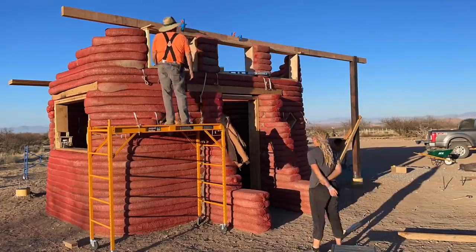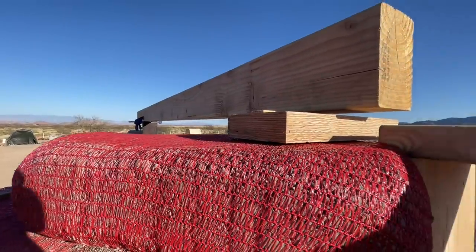We were overthinking it and Ashley's dad said, 'Listen guys, it's not that hard. Just make sure that where they butt up against each other, it's on a supported surface — not in the middle of a window or open space. Then take a really long two-by-four and screw it all together into one piece.' Just one side. During that process, we also put in shims to make sure there wasn't weight on the window frames, and to level it up because one side of the building was about a half inch shorter than the other.